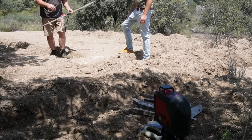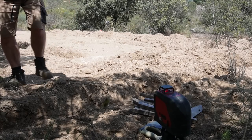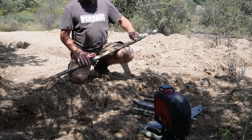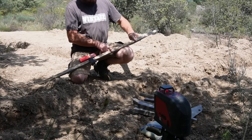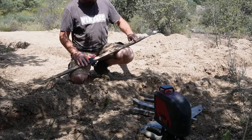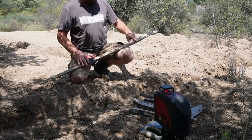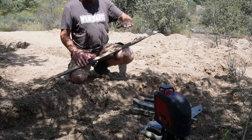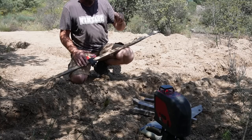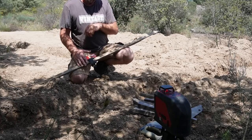Okay, so we have a difference there to there to make up in the foundations. Hopefully it's not far off 400 mil, it's about 500 mil. So we should be able to work our way along with the staff, driving pegs in to concrete level, and where it needs to step up, where the concrete gets too thin, we'll put a block across and step it up 200 mil and then take it from there.